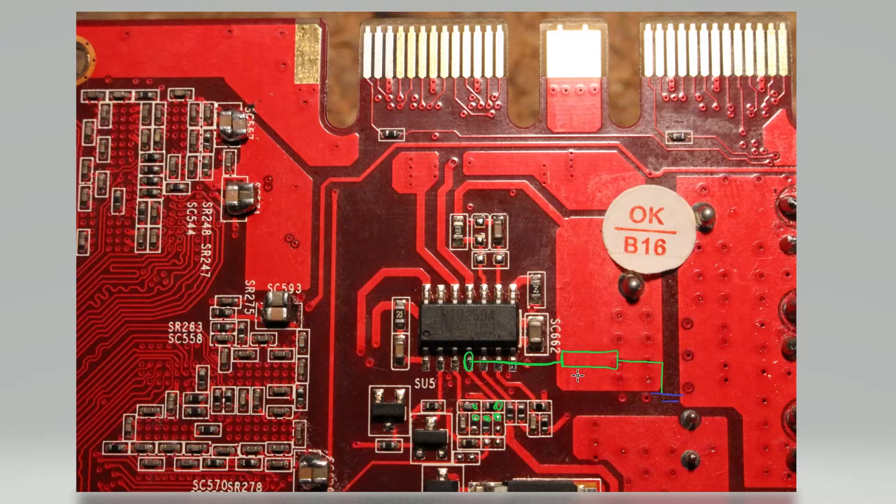There's usually only one capacitor on here — the second one I put on myself. And here, and on the right of these. So that should be enough accessible grounds in the area. Personally I used a ground from one of the DVI ports because my variable resistor is up here somewhere, and that was the closest one I could solder onto without using any wires.